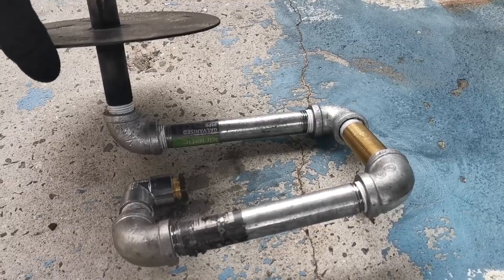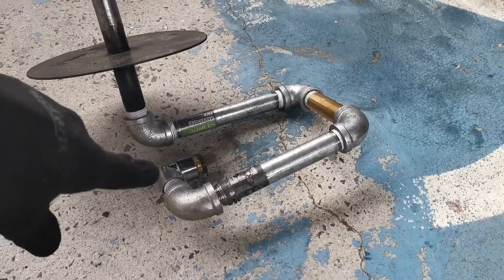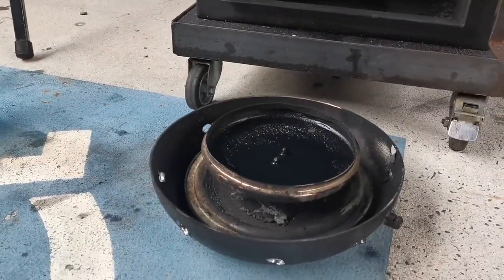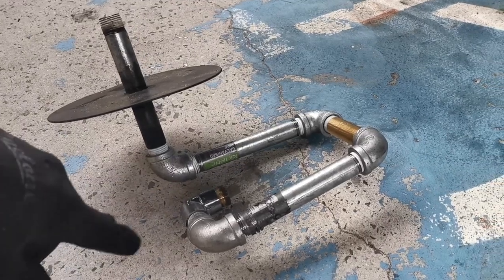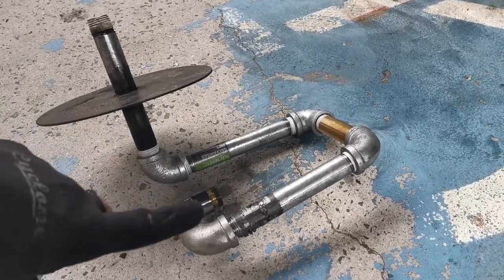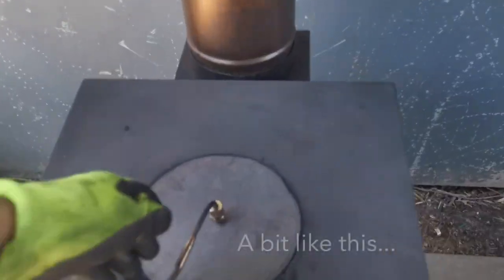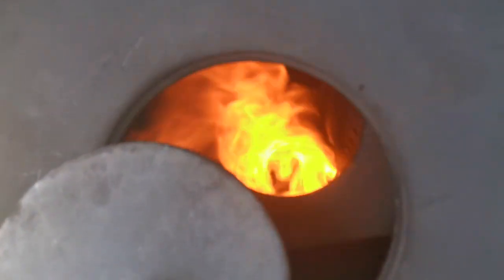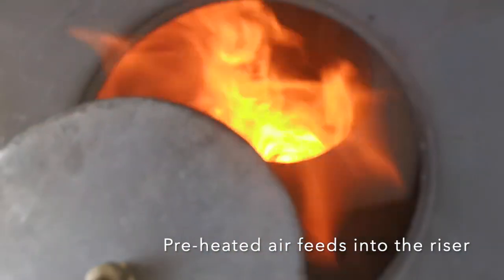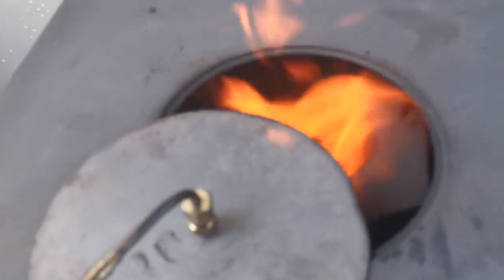What I'm going to do here is try to combine the two systems. To get this up to temperature I need to have something like this underneath it anyway - some kind of plate system to catch the drips of oil before it gets hot enough to ignite them, make the whole system hot, and then once it gets hot it will start vaporizing in the pipes and jet out of the nozzle and blast into the rocket riser. Very nice, very clean. We're getting re-burned air from the tertiary air holes - the tertiary air feed is actually working. The flame coming to the top has no smoke in it, it's totally clean.